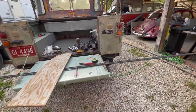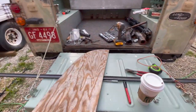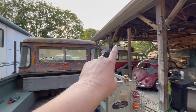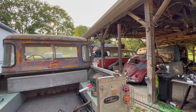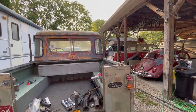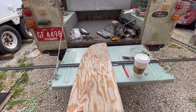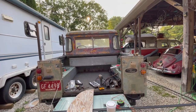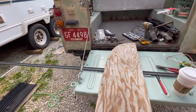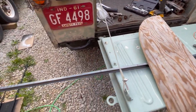So rather than pay someone to bend that, I've made a buck — set them on a plywood buck of the roofline and put a piece of cardboard up. It's actually almost exactly the same as the bus, so I still had the bus pattern. I cut the bus pattern in half to keep half for a Volkswagen, made a new one that is now a Land Rover half, then made a buck of plywood with that. I'm not stupid enough to think I can just heat this and bend it, so I am going to pie cut. I've marked it here.